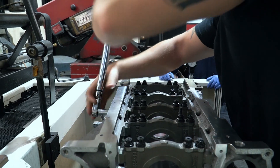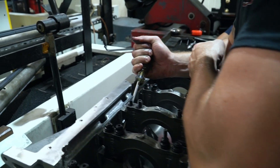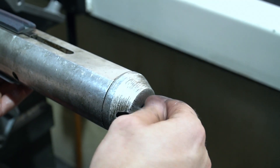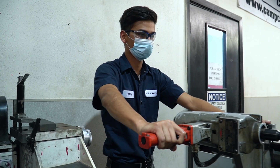On this line hone operation, once the housing bores are where they're supposed to be, how do you get the mandrel centered in the block? There are a couple of different ways. You can do it with a dial indicator to check it for centered in the bore. We do have the pin style — you can remove one of the caps, usually reuse the center cap, remove that cap and put the dial pins in, center the mandrel that way adjusting the shoes, and then once we have it centered, we'll go ahead and set the pressure with the stones and the overstrokes.